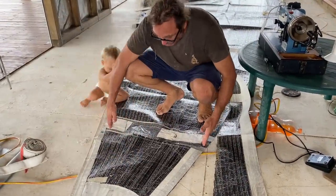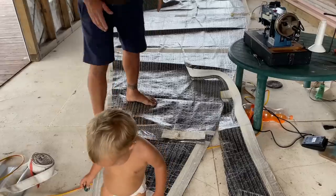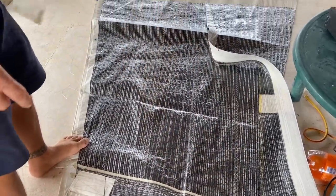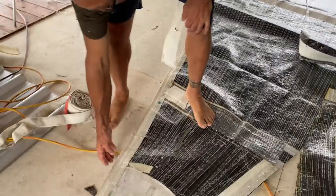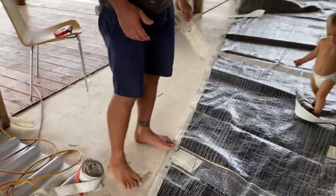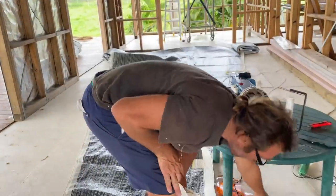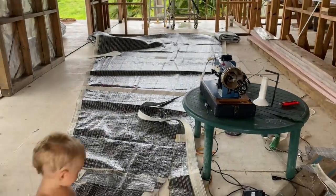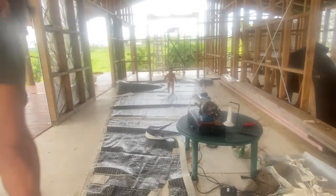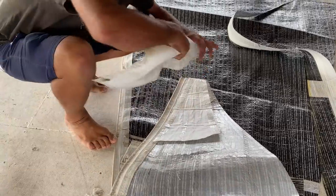The batten pocket is now short so I have to rebuild it. I have to re-pass the rope inside the leech and restitch. We continue to reinforce. Also the insert of the tough luff is broken — not perfectly stitched because it's very difficult for our machine. I requested a sailmaker to restitch it with the correct machine to make it stronger, but I think it will resist for now. I continue the job to reinforce the back of the sail.